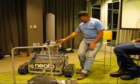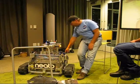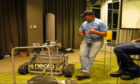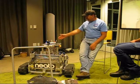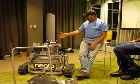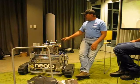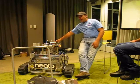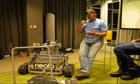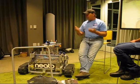The TK1s have a USB 3, so we have two USB 3 hubs, and Hans back there did the mapping of USB devices to the various master and slave through the USB hubs, and all of the Linux configuration to get those devices to come up the same every time, because you have to be able to turn it off with this power switch, and the power switch actually disconnects the battery, so it cold boots the Linux boxes, and everything has to be synchronized when they come back up.